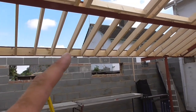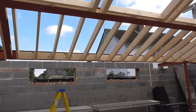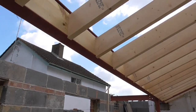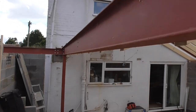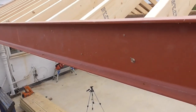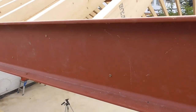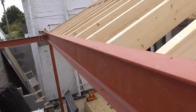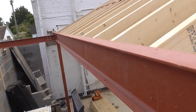As you can see, I've just solid blocked in between those rafters there. What that does is stop them getting up to mischief if they want to move or twist. The other really handy thing here is I've fixed the rafters into the steel and nailed them in, but because the steel guy has been so conscientious about the guys coming behind him — he's drilled this out, stagger-drilled it out — I've been able to just screw straight through the web of the steel. When you get someone who's not only doing their own job but thinking about making it easier for the guys that come behind them, it's a real treat.